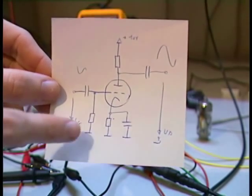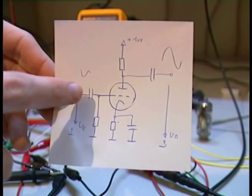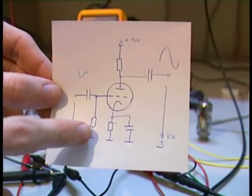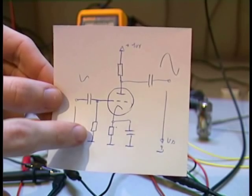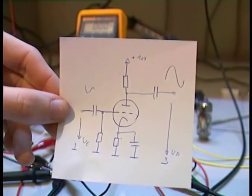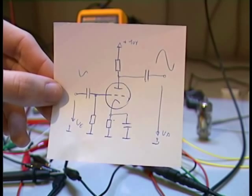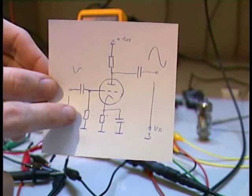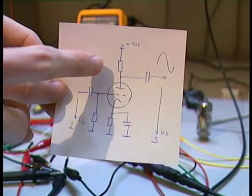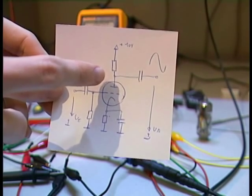Let's start with the parts. This is the decoupling capacitor — it is for decoupling the DC offset voltage. This is also a decoupling capacitor. This resistor here is the input resistor, which keeps the grid of the tube from floating. This resistor must have a value of about 100K, which is also the impedance of the input. With this resistor you can calculate the capacitor value.